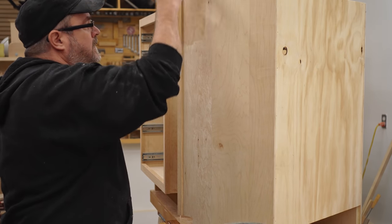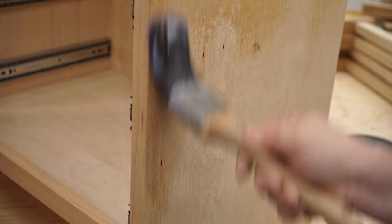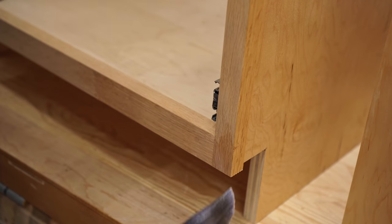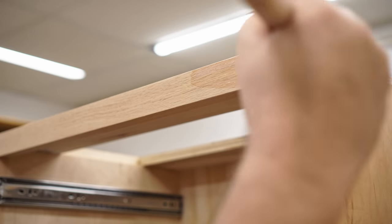Now to finish these off before I install them, I'm going to apply two coats of clear water-based polyurethane. That completes this phase of the build. I'll be installing these shortly, and then I'll be building all of the drawers that go in these cabinets, and that'll be the subject of the next video.